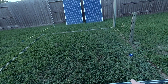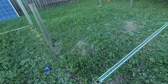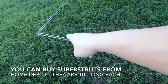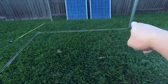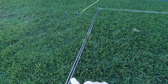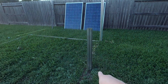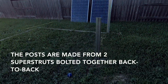I'm going to show you how to measure and make this one section. What I do is pretty simple — I don't do a lot of calculations, I just use templates. I use unistrut or super strut; each one that is not cut is 10 feet. So these are 10 foot right here, and that one right there is 10 foot. This one right here is not 10 foot — it's about 9 foot, because it's cut to the same length as these. I'll have another video explaining how to make these center vertical columns.